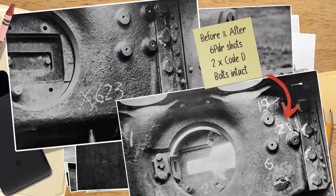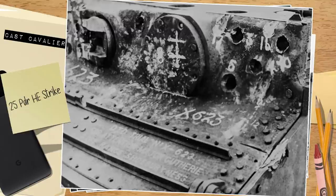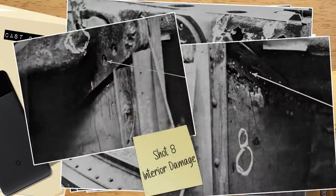In this case the cast armor held up well, with the first rounds loosening a few bolts only, but the armor held. Round 4 of the 6-pounder ammunition caused a split in the nearside angle bracket securing the casting to the main armor. Rounds 5-7 were shot into the cast parts, which still held up although more bolts were loosened, though not sheared away. However, round 8 was a 25-pounder high explosive round at full service charge. When this struck the machine gun blanking plate, it failed to damage the armor, but the seal between the cast and the nose lost 20 bolt heads sheared off, a visible gap formed between the casting edge and the hull side, while on the inside seven bolts and two rivets were sheared off and the casting attachment to the inner bulkhead was bent.